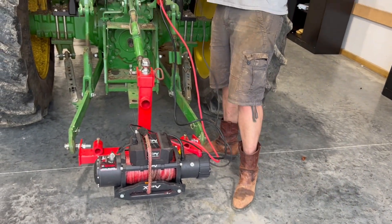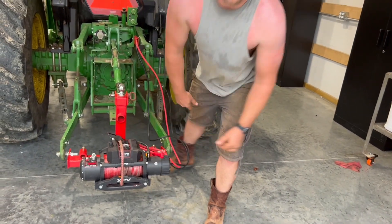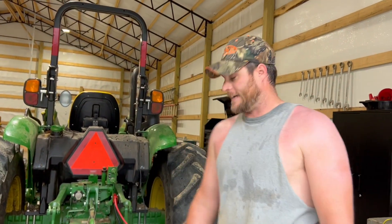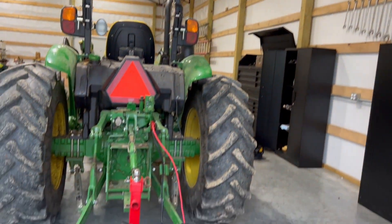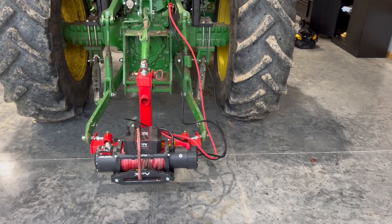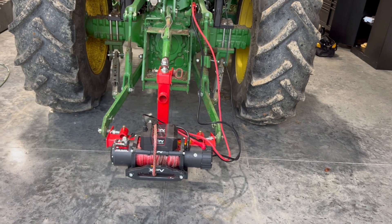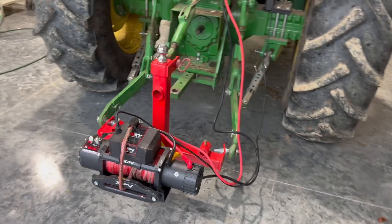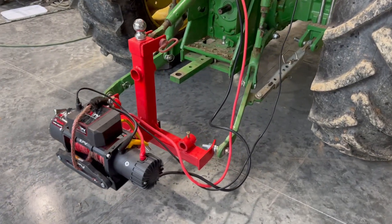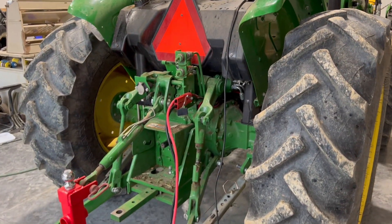One last thing — in order to be able to put this into a winch I did have to buy an adapter plate, which I also got off Amazon. That's my setup and it worked pretty well. This is a way better setup than using a boom pole. A boom pole will lift the front of your tractor up and it can be very dangerous. This is low, as you can see here, so it's giving you a lot of force to be able to winch logs out of the woods.